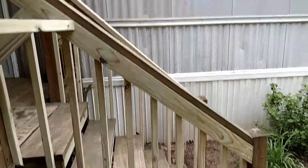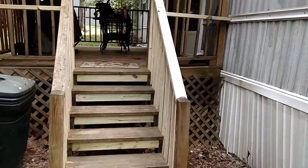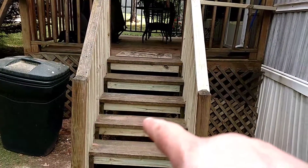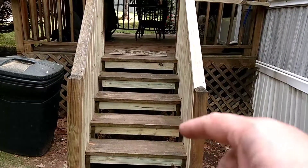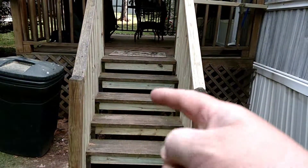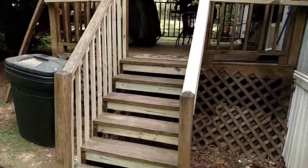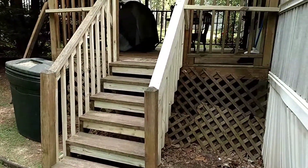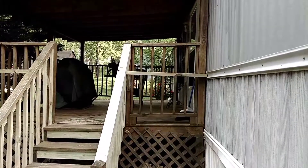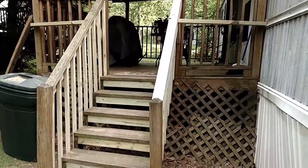There it is, and yes, I realize that right there is a toe hazard where you can get your toe caught. He's going to come back up here tomorrow and stick a two-by from that one down to the back side of each one of the treads and screw it all together so you can't stick your foot in there. Those pieces right there just help stiffen that corner up and serve as a base for a planter box to set on.